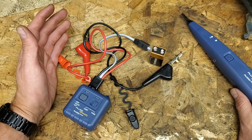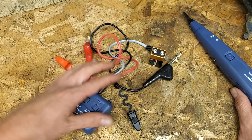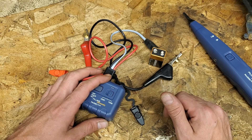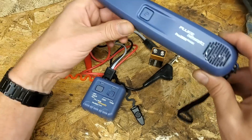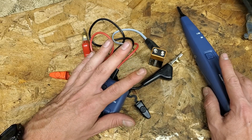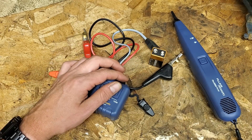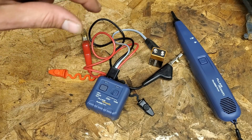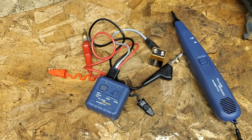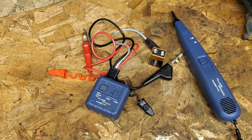Like I said, it does a couple of other things - polarity, continuity, wire tracing, and you can hook it up to Cat5. It's a pretty powerful little device. I think it cost me about 80 bucks. Fluke bought the company that used to make this and branded these things as Fluke Networks. And I may or may not have mentioned - don't use this on live circuits. It doesn't like it. So that's it - my new wire tracing device. Anytime I need to trace wires, I'm all set. Thanks for watching.